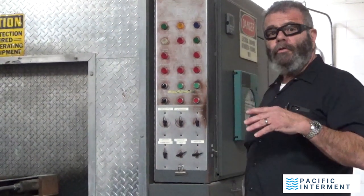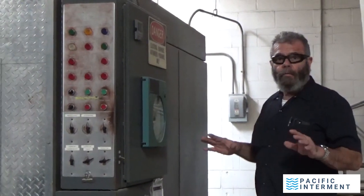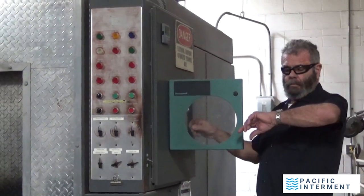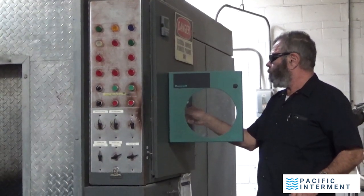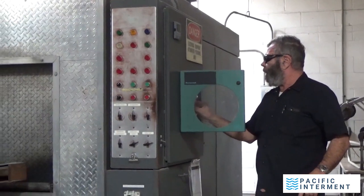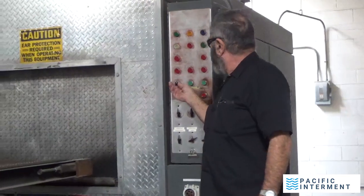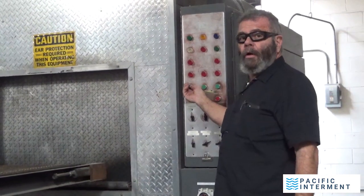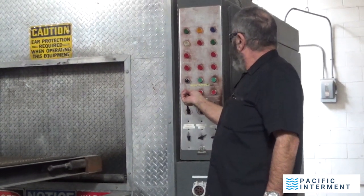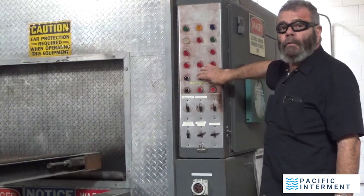So I'm going to walk you through the startup, show you everything I do here to get the machine ready, and then we'll see you on the next video. Just adjusting the chart recorder wheel so that I get an accurate time on startup. I'm going to come over here, as I showed you. I'm going to turn the power off and back on. I am going to turn the pollution control on, and I'm going to turn the blower on.